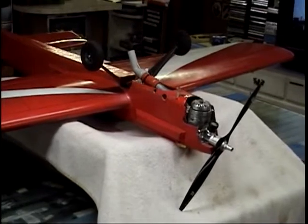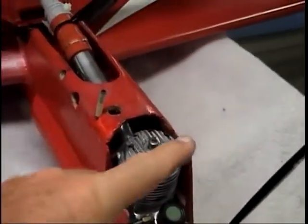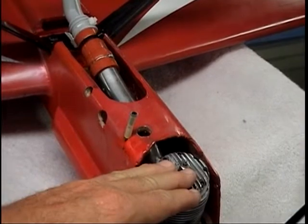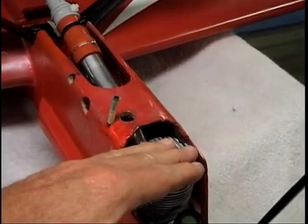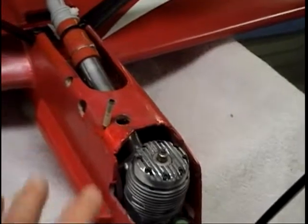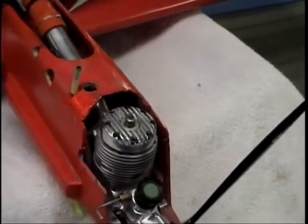Now we're recording all the test results from today. The big thing today is we want to get the tank shimmed. We used Richard's original number. It was off a tad. We went up an eighth. That was too much. Now we're going to go back down a 16th. In other words, we're always cutting the difference in half. If we go too far, then we'll go to a 32nd. But we'll get that close. It's still not as close as I need it to push this further.